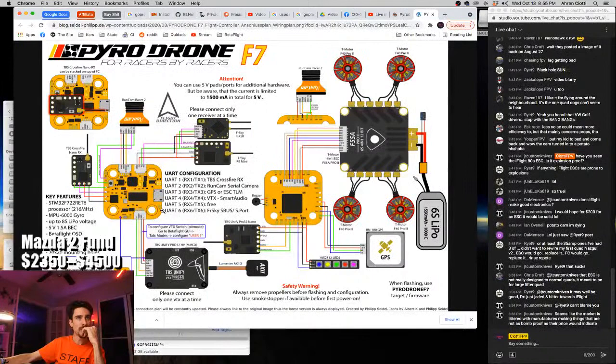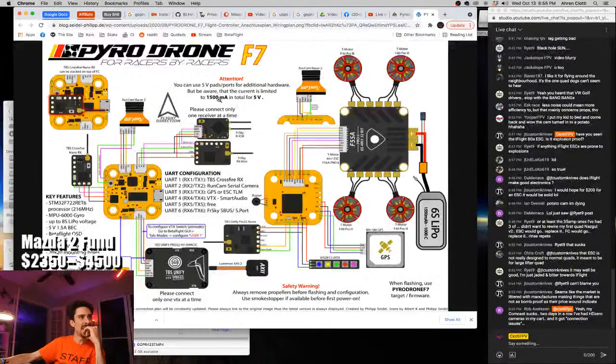It's better. Just kind of looking around to see if there's anything. Any other pads that I want to be aware of. Those are the LED pads there. So this side is going to be in the back, so what I'll probably do is tap into this LED 5-volt and ground here, in order to power the little microphone that I have on there.